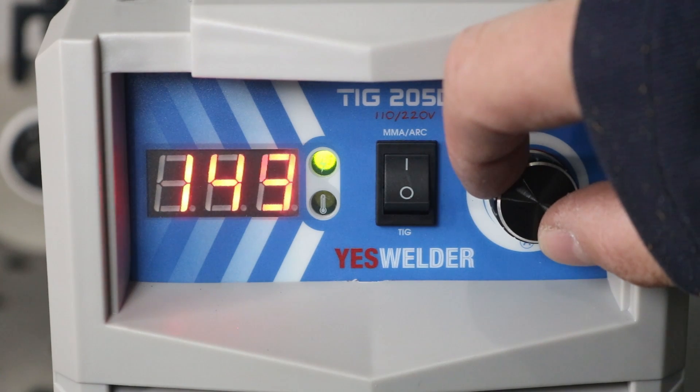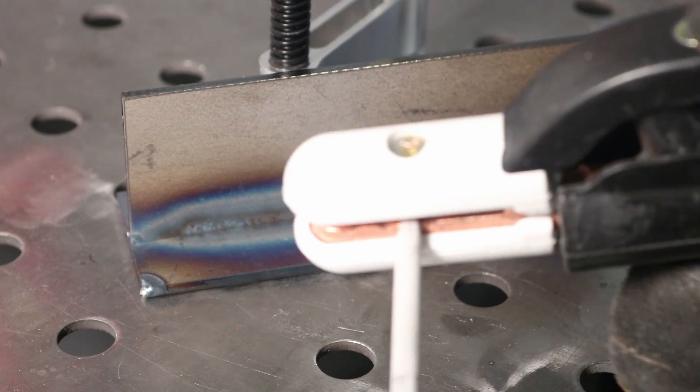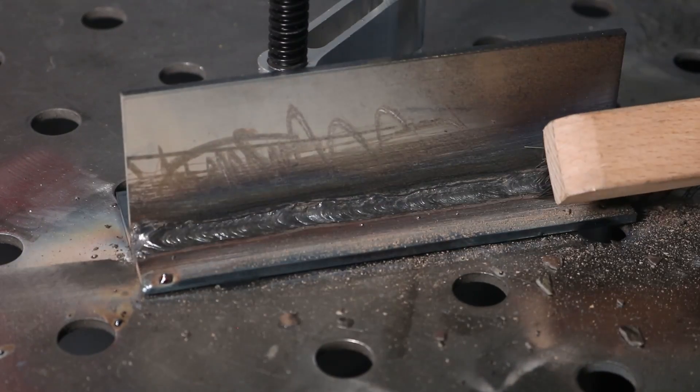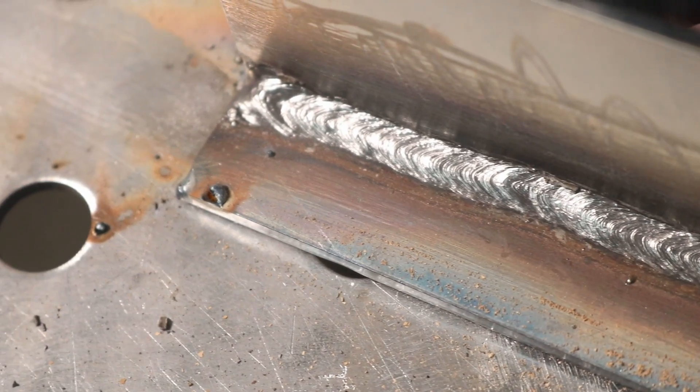Now let's change it over to stick welding mode, or MMA — manual metal arc welding. I'm going to turn it up to 150 amps and run good and hot with this one-eighth-inch 7018 electrode on these one-eighth-inch coupons. I'm going to strike up an arc, get established, move back into the start of the joint and then just weld along, trying to maintain that consistent steady angle and a really short arc length. I'm welding along at a pretty good rate just to keep a reasonable size fillet while still letting it fill out so that I don't have any areas of undercut — where the metal in the base has been melted away but hasn't been filled back up with filler metal. And it went pretty well — got a good consistent stick weld on it. That's a really nice feature so that you can just take it with you without taking your gas cylinder, or if you're doing structural stuff, sometimes it's a bit faster. I got a pretty good 7018 stick weld there, so I'm happy with that.